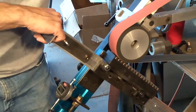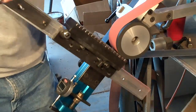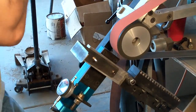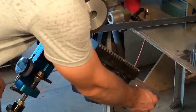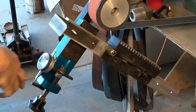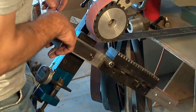For any of the vertical grinders this attachment is used for, I highly recommend — when you're using this — just putting a bolt in here while you're using it, just to avoid the chance of being a little overzealous and pulling yourself off the slide. A 5/16-inch coupling nut over a quarter-inch bolt works nicely — you can just tighten it up there.